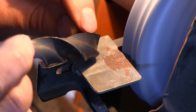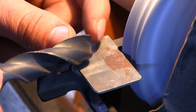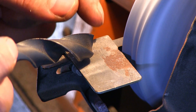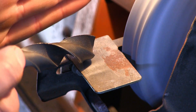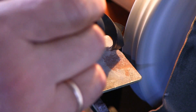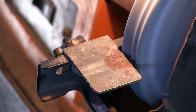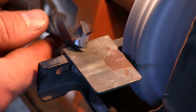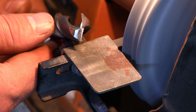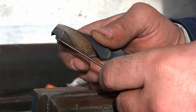If you don't want to do this procedure it's not critical — you just need to start using a bigger pilot drill. The key is to keep the cutting edge parallel to the face of the stone, or even more inclined, because the cutting edge needs to be the highest point at all times. That's what we're trying to achieve regardless of what sharpening method you use. If you don't have much experience sharpening drills, it's always better to undercut the webbing before you start sharpening. Once you gain experience you can do it after, but it's good practice to do it first.